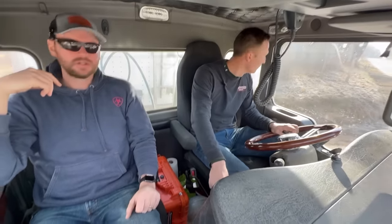And we were talking about cords of firewood and kiln drying them and how much weight you lose from green wood to kiln dried wood. You said you have a pretty good idea of how much water comes out of a cord of wood. Yeah, when we first started kiln drying, I have a set of scales that can weigh a whole half cord of wood at a time. We weighed it when it went in, and then we weighed it when it came out, and we lost 1,500 pounds of water per cord in one kiln run, just in water weight. 1,500 pounds in one cord? In one cord of wood.